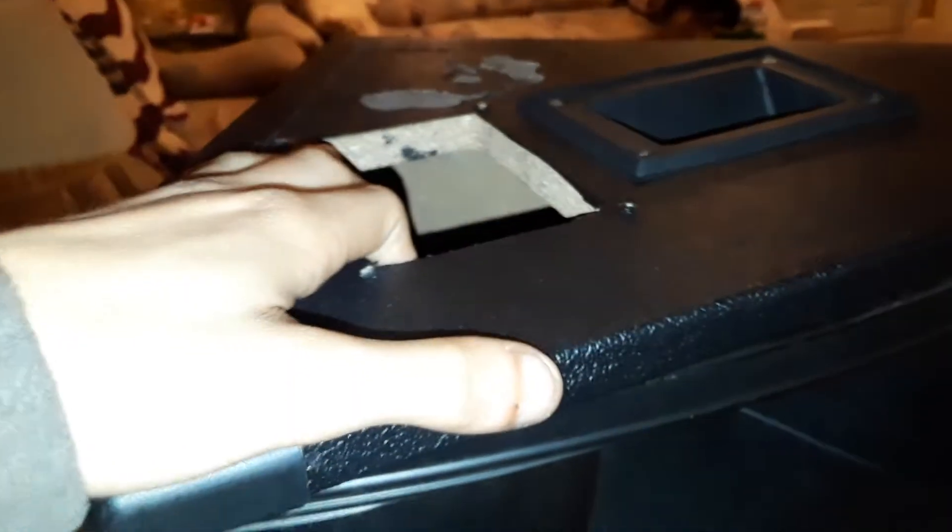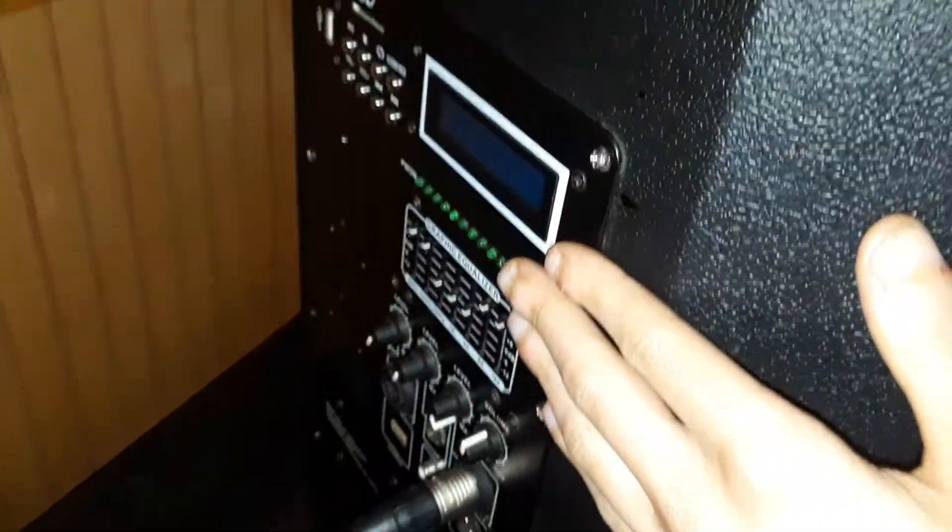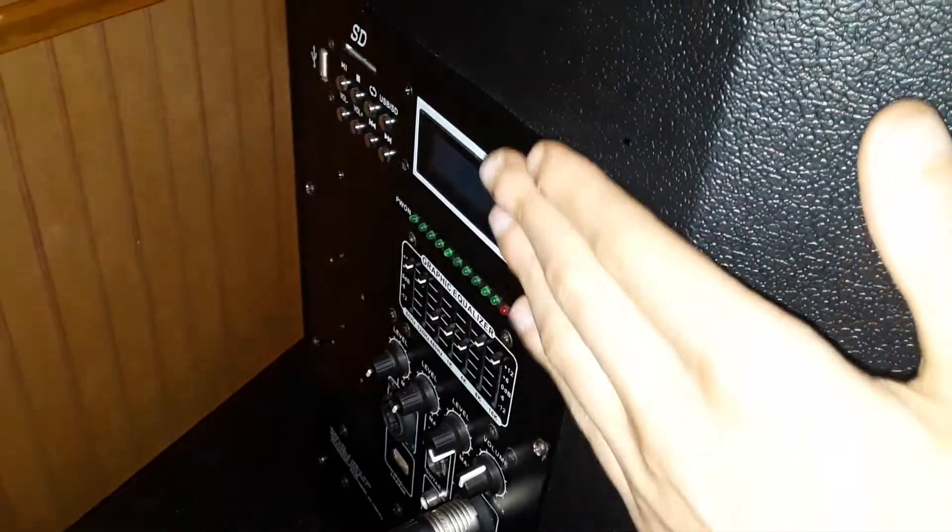I'm meaning to cover that with something so the bass does not come through the top, knowing that there's some ports over here. So technically I just took the passive inputs from here, took that out, and I actually took the amplifier from the GLI X-Jam 15 iPod, cut a hole, screwed it in. You can see from the inside — that's a compression driver, that's a 12-inch driver, and then we got the amplifier module over there. Very easy build to be honest.